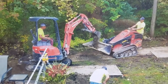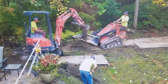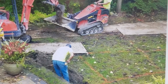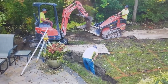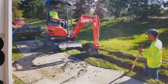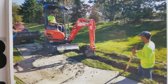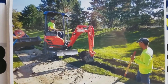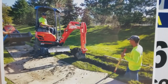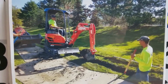We use an excavator or backhoe — you can see the gentleman down in the trench. We're ditching out a really nice French drain trench, taking all that dirt out. Notice how there are no piles of dirt anywhere on this job site. As soon as the shovel gets a scoop of the heavy soil, he's putting it in a mini loader and we're getting it off site. We have a spotter in the trench looking for sprinkler pipes and taking topo readings with a laser level and transit on a tripod, communicating with the operator.